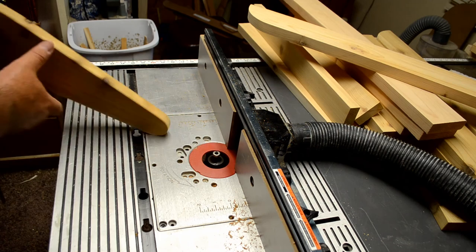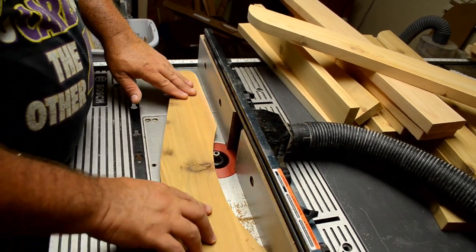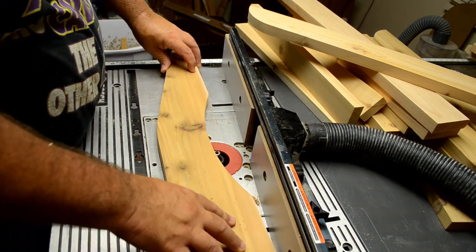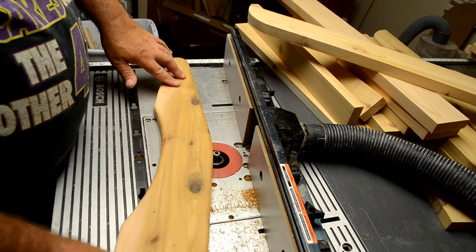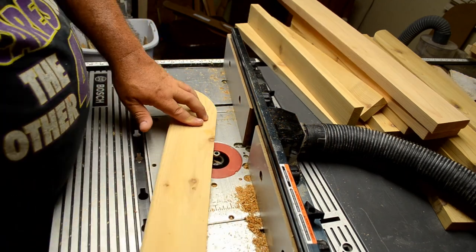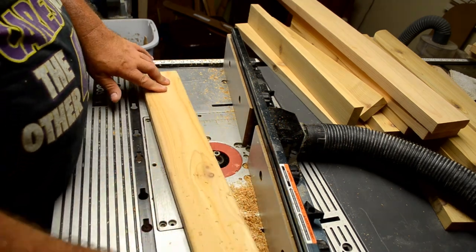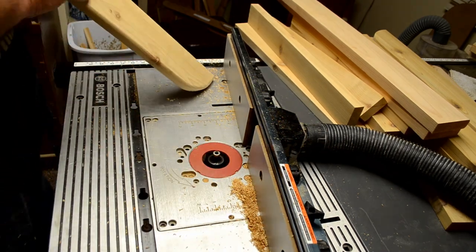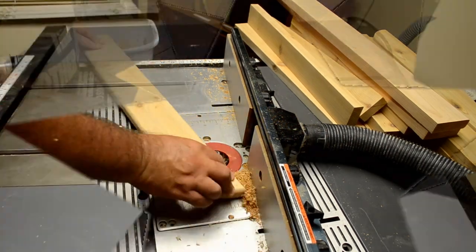Now this is my own personal preference. The actual plans call for some of these boards to get the exact same round-over as the factory boards have on the edges, but then you cut a lot of that factory edge off, so they want you to come back and replace it with the same round-over bit. Well, not all of the boards — but me, I went ahead and rounded over the majority of the boards.